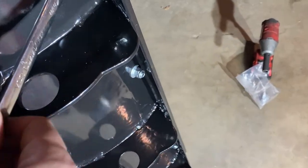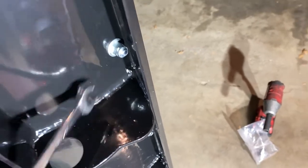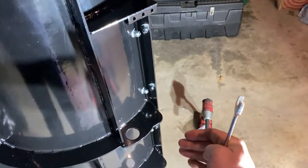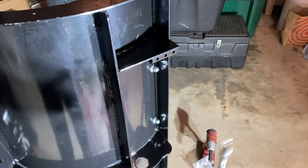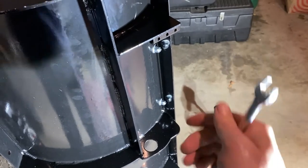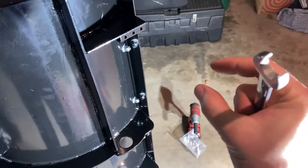The directions say to start by tightening the center-most bolts and working your way towards the outsides. I'd recommend tightening all bolts to the point where the heads are flush and the squares on the shank are fully engaged, but there's still a little wiggle. That way, if the holes weren't drilled perfectly, you'll still get a little movement to get everything lined up. Once everything is snug, you can move the edge as needed to align it.